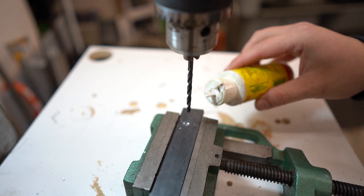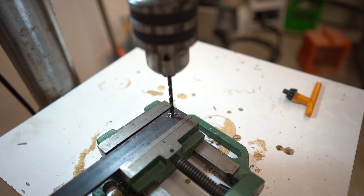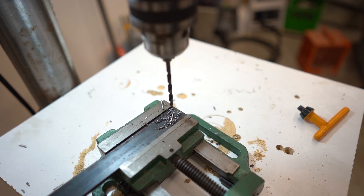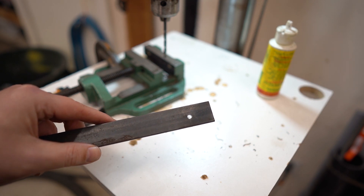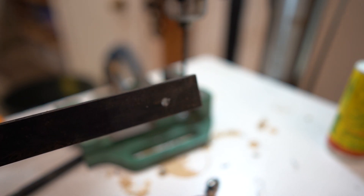I generally use a little bit of cutting oil — in this case Rapid Tap. It doesn't take very much, not for a hole this size anyway. Steady downward pressure wins the day. You can burn up a drill bit if you don't use enough pressure or you run it too fast. Get it right and you'll get some nice big chips, and you'll progress through the metal really quickly. The operations are done, but there's one more critical element once you drill a hole — that's deburring. Getting rid of those sharp little edges that exist around the hole so you don't cut yourself open by accident.